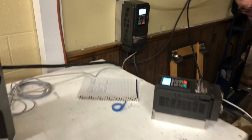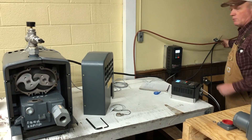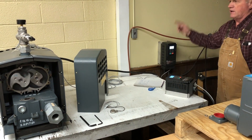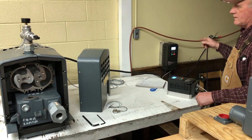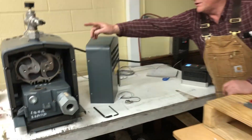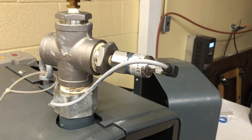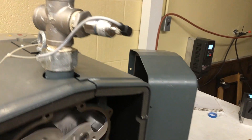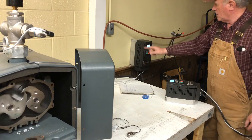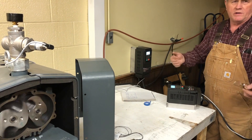This is a three-phase motor, and most farmers don't have three phase. So what we do is take 240 volt — people call it 220 — which everybody has in their sugar house, run it through the drive, and convert it to three phase. We can set this to run at whatever hertz we desire. We also put a pressure sensor on it, and we can program the drive so that once your woods comes down to 27 and a half inches of vacuum — about as much as you can get out of a dry claw — the pressure sensor signals the drive to slow down and maintain that 27 inches, which saves energy.